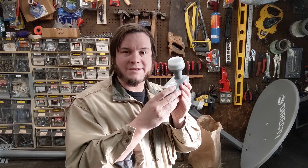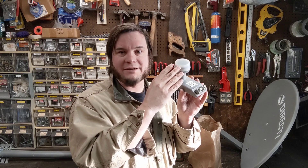I also went to Axeman and got a different LNB. What this does is down-convert a microwave signal into something more in the gigahertz range or sub-gigahertz range so that you can actually listen to that signal with a software-defined radio, which I've been playing with in some of my other videos.